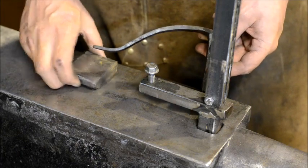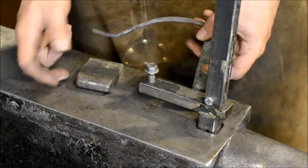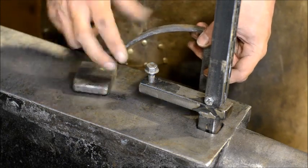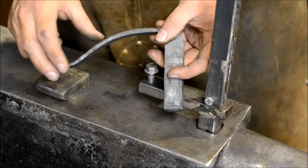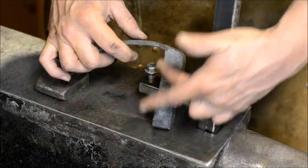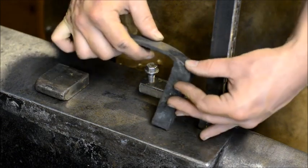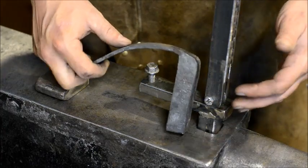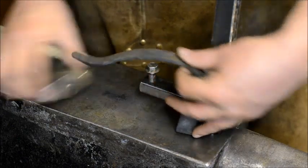So say you created a tool and it may be able to hold up to three quarters of an inch down to maybe three eighths or as far as quarter inch and you'd still be able to get the tool to hold material down. Anything bigger or smaller than that and the traction on the shank of the tool doesn't wedge enough into the hardy hole of the anvil — or the pritch hole if you're using a round type — to actually stake the piece down, and you end up having pieces wobble out.